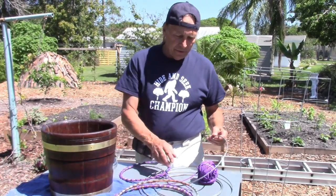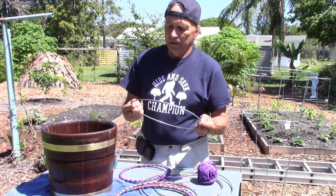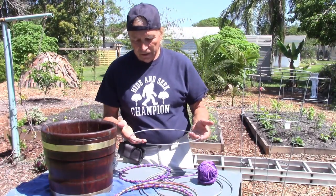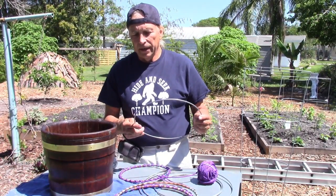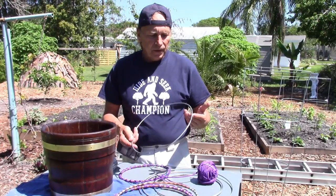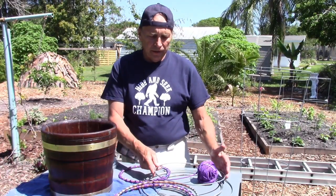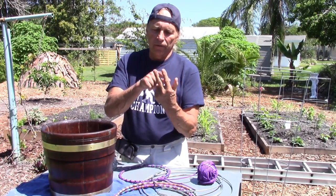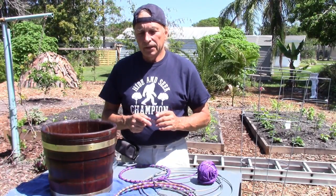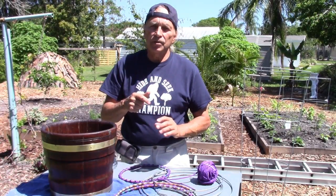If you want a heavier gauge, this is about a 3/16. It's the larger tomato hoop that's made, and I think these are about $5-6 for the tomato cage. You could go to the hardware and buy 3/16 or a 1/4 inch rod and then bend the rod. And the way I bend the rod is I'll use my vise. In the past, I used a fork, a piece of metal that bent U-shape, and I would place the wire between, and just little nudging at a time between those two stationary points, and it'll bend a hoop.